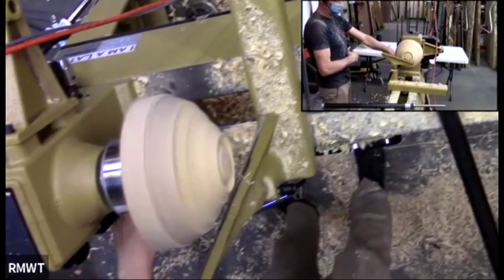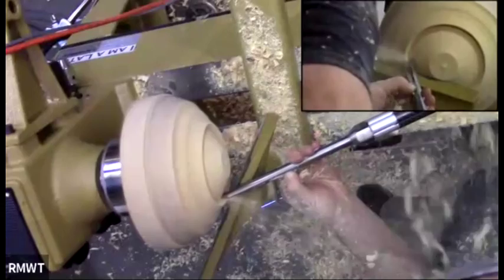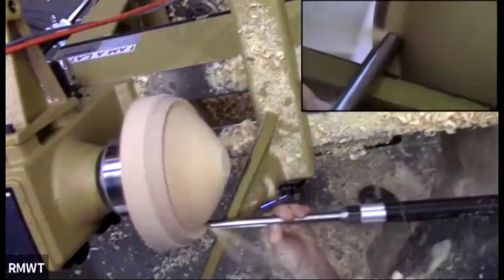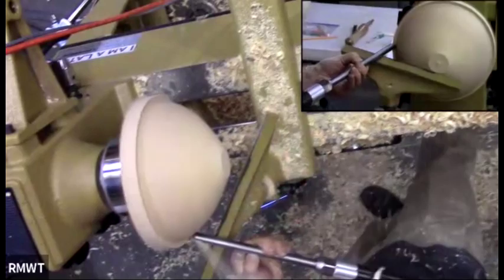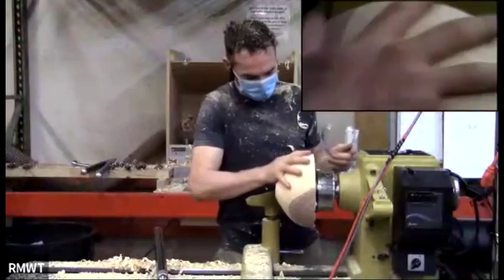So I can't take 5/8 on this. There's no way. Well, you can hear it. It will dissipate in a second. It always dissipates when you go to a certain spot. I can still hear it. So what you'll see is vibration marks. So I'll leave it as that. They're there. That's it. So you can take 5/8, even with that vibration, you can hear.